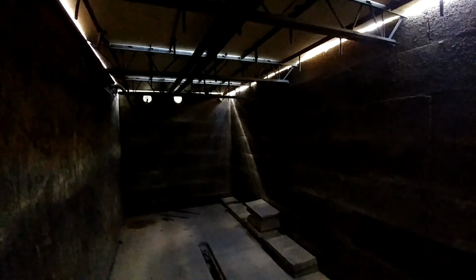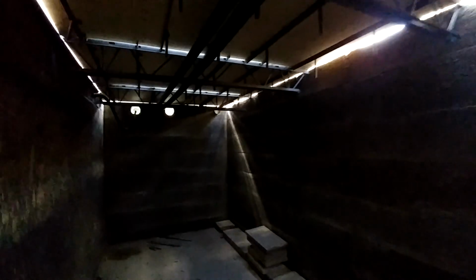All right. Now I'm down inside the cellar to get a better idea of the joists. The joists are at four feet on centers. There's a bracket because the first and last bay is a little bit shorter. There you see the roll bars as they go inside the little brackets, and the plywood is actually resting on the roll bars, not on the joists.